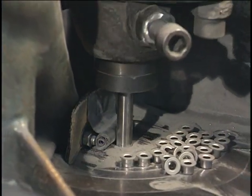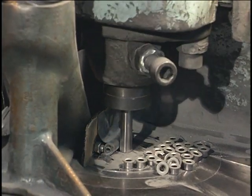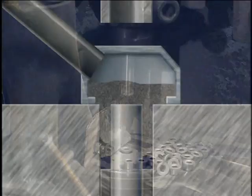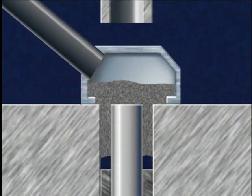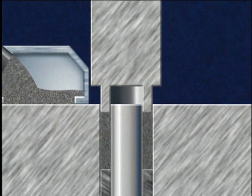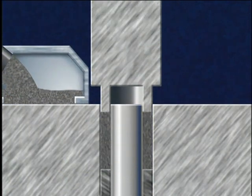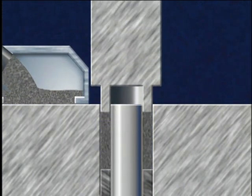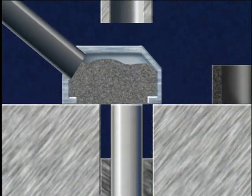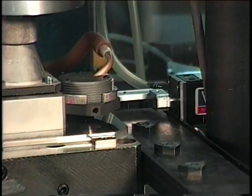Core rods are used inside the die to control formation of holes parallel to the direction of pressing. If the part being made is thin and uniform in height, the powder can be pressed from one side by the upper punch. When that punch withdraws, a lower punch raises the part out of the die. The part is then ejected by the wiping action of the powder feed chute, which also wipes powder for the next piece into the die. Ejection from the press can also be accomplished using automated handling equipment.